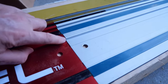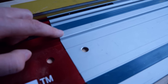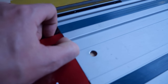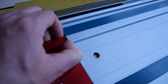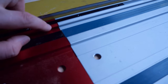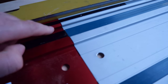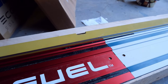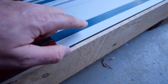They've gone together straight, which is the first step. Looking closer at the front where the saws ride along — the Makita is coming up a little bit, sticking up just a bit. The Milwaukee sticks out the back slightly. The Milwaukee angles down a lot more at the back groove and has a different profile shape to the Makita, so there's a clash point there. The front of the tracks look pretty well lined up; the splinter guards are slightly different — the Makita one has been cut away a lot more.